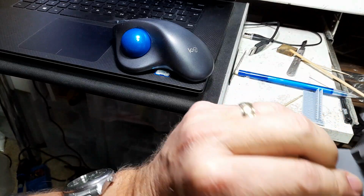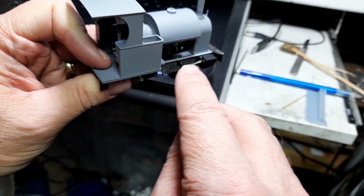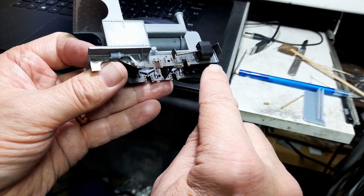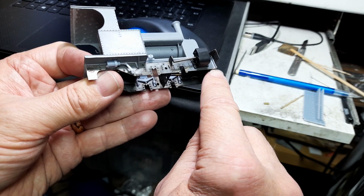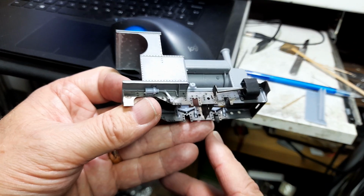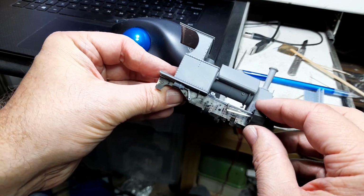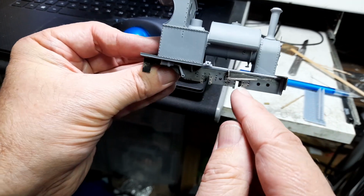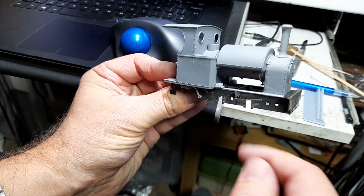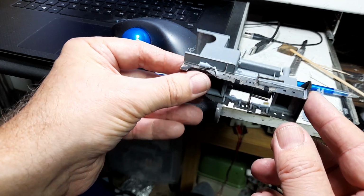is the loco itself. And I've just dropped a cylinder, but that's fine. And this shows progress so far. Now, you can see it's the chassis reinforcing angle on top there, and also there's a bit between the frame and buffer beam. And it's very easy just to cut it off and epoxy it on. Again, I use Devcon, which is my preference. So this is progress so far. Now the only bit that isn't glued on is the cylinder, because I've got to make the crosshead and slide it on before I fasten the cylinder. A rather backwards thing to do, but that's life.